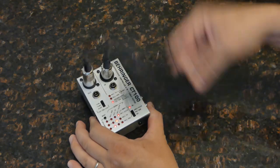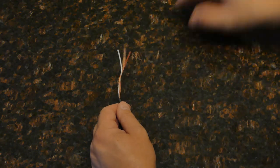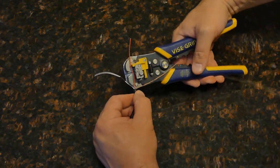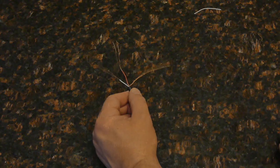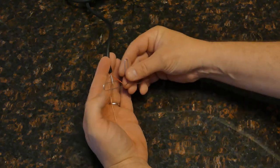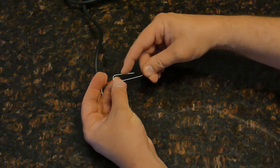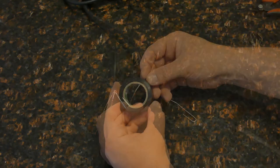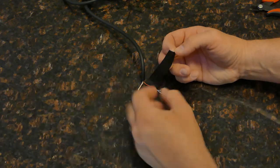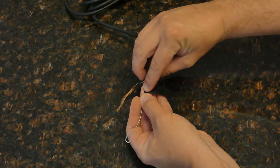Now that we have the pinout, let's make our cable. You can see we're starting with a perfectly working cable. Start by cutting the female end off your XLR cable, strip off all the insulation, and expose all the wires inside. This is a very cheap cable so the wires are not very thick, but twist the copper on each wire to keep them together and from touching. To make the pins that go into the microphone, we're going to use paper clips. Open up the paper clip most of the way, wrap the copper from one of the cables or the shield around it, and slide the wire into one of the loops. Pinch it with pliers to keep the copper from slipping out, and then cut off any more than about half an inch of excess paper clip.